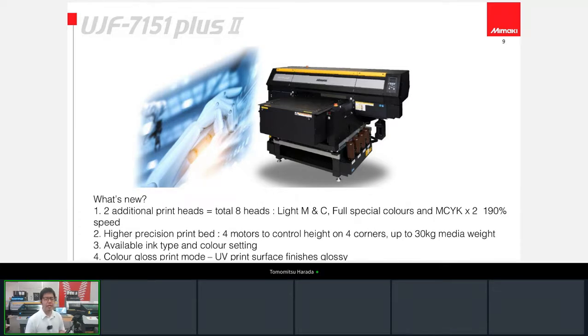So the new functionality, the 4 points: two additional print heads, so a total of 8 heads, where the previous plus model has 6 print heads. So the total 8 heads model supports light cyan and light magenta for a total of 6 colors of full color printing for high quality half toning printing. Or additionally, we are able to support dual CMYK in order to make 190% of the speed of the plus model, or four color plus spot color mode.